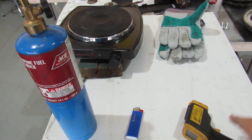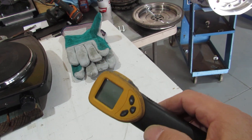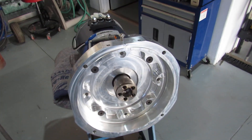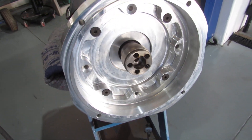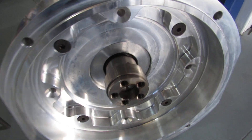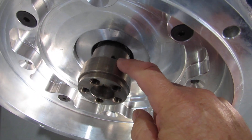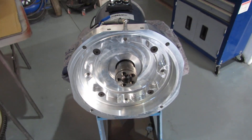Then using my probe here, I got it to about 350 to 400 degrees throughout the whole coupler. And sure enough, it just slipped on like butter — it just clicked on real fast. I held it in place for about a minute, and then set the set screw right there onto the key that goes right inside there. So it's on there just the way it's supposed to be.